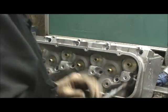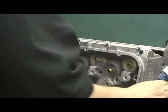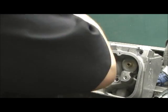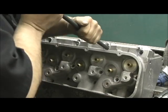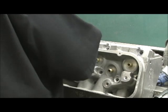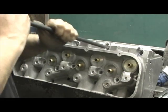About eight or nine passes — put a blow there, then try to get the squeeze. It still won't even go down in there, but it's going a little farther each time. I'm going to change rolls and get something a little coarser — it does wear out fairly quick. The thing is, you go in there buzzing at it too much and you get it where it slides through — once you've done that, that's it. I'm getting some movement now. I'm going to stop at that point, mark it, then turn her around and attack it from the other side.